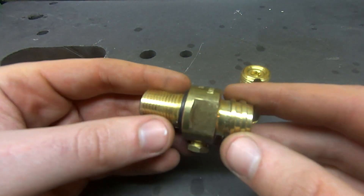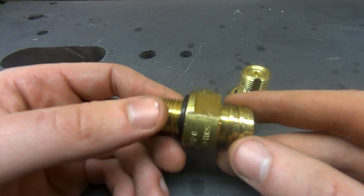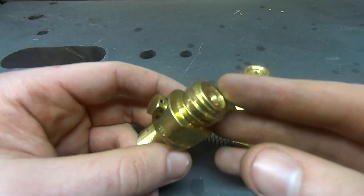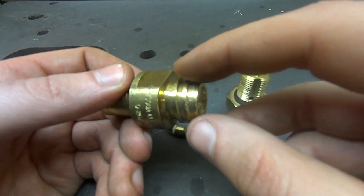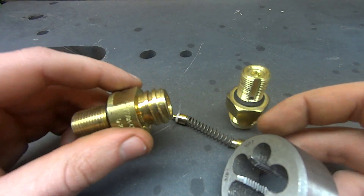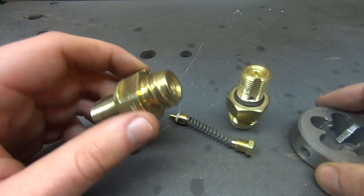All you have to do — you don't even need a lathe for this. You could use a drill press. If you're really desperate, you could probably grind these off by hand or on a grinding wheel. What you should do is chuck this in your drill press or lathe, take these threads off. Then you can use a 3/8 inch die — like this right here — and once you take this down to the proper diameter, you just put your die on there and cut new threads onto it.